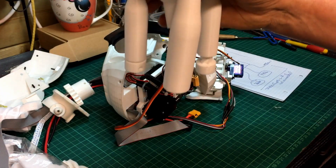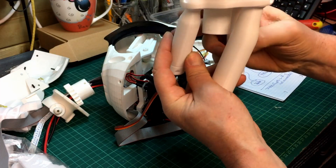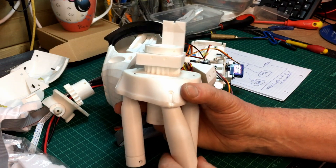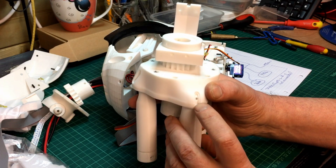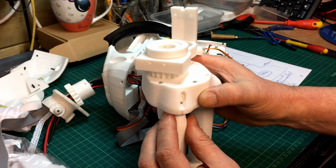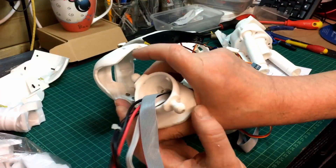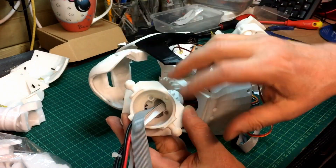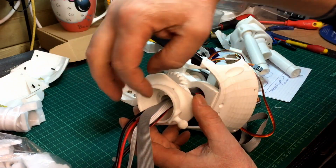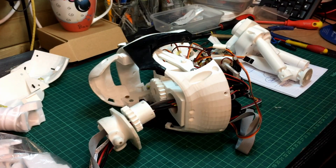I've got that together — that's the front piece, then the two back pieces. It's a lot stronger. There's a slot that would take a screw to stop it turning, and the same with these. It's going to be a lot stronger than the old method, which was just small little pivots. Those worked but the piston would sometimes twist on them. Hopefully that will be a lot tougher. Just sort of looking at my options on it — that's it for now.